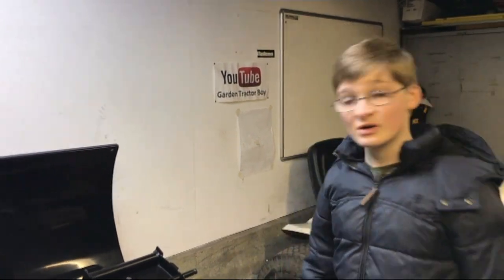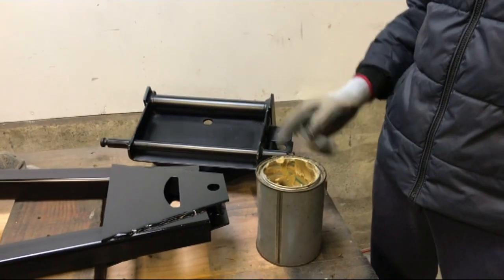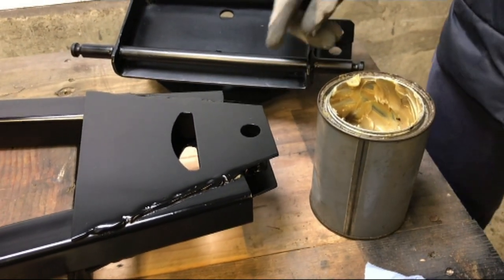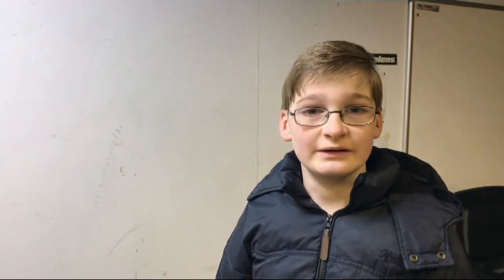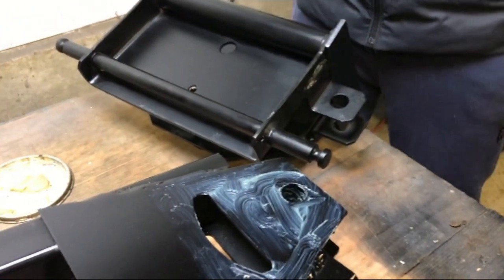Now that we have all the parts in paint, we need to fit up the blade. We're going to take some of the parts off the bench so we have some workspace to put stuff together, and then when we have everything together, start putting it on the tractor. The first two parts we're going to put together are the mainframe and the swivel bracket. Before we do that, we're going to put some grease around this area, which is where the bracket will actually swivel, and on the underside, in an attempt to protect the paint and make it more smooth while it's swiveling. We'll also put some in this hole, but not too much, because the pin that goes through there is drilled down the center and out the side with a grease nipple, allowing us to grease in there while it's assembled. We've greased up both brackets and put a bit of grease around the outside of the pin and in the hole. Let's put them together.